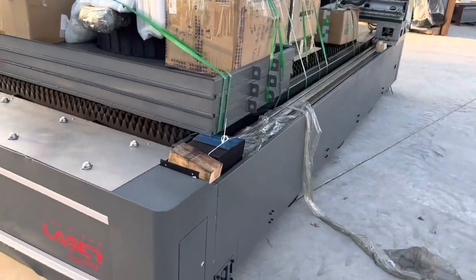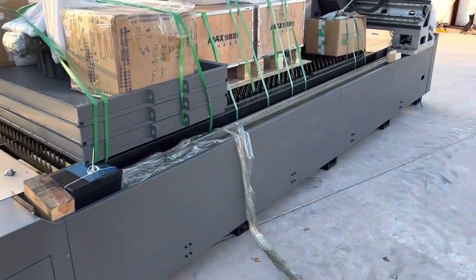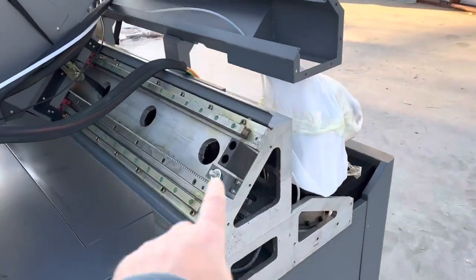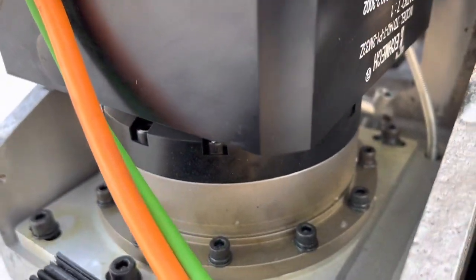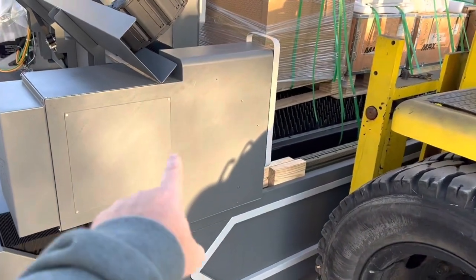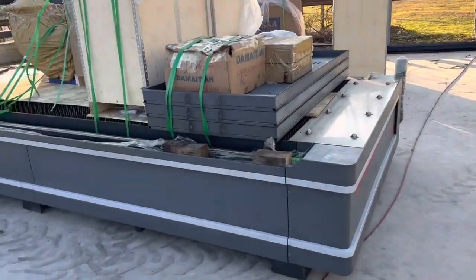You may be asking yourself, why do you need an 11,000-pound laser? The reason is to maximize cycle times and get the machine moving faster for more productivity. More importantly, it's about cut quality — a lower-accelerating machine is more difficult to dial in for thin material to cut accurately and repeatedly with no burr or minimal burr. It's much easier on a faster-accelerating machine and almost impossible on a lower-speed, lower-accelerating machine. A lot of machines on the market look the same with sheet metal covers, but underneath there's a great difference in build quality.